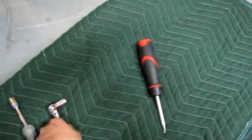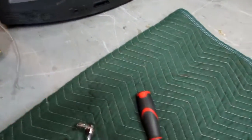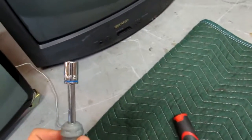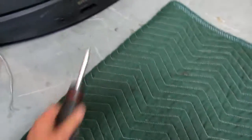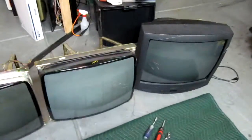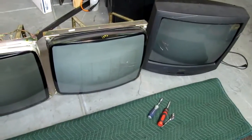I'm going to take it apart. The tools needed are some simple wiring tools, and for mechanical work stripping it apart, you need 7/16ths for the K7000 frame — there are just four bolts up there. Then once you crack the case open on the TV, it's 10mm for the driver. It's just a simple driver and screwdriver. You also need a nice blanket — I have a moving blanket here. I'm going to lay the TV and the monitor face down and then we'll get cracking on it.